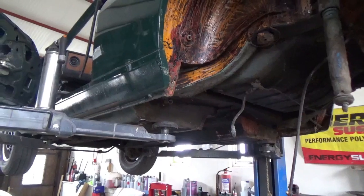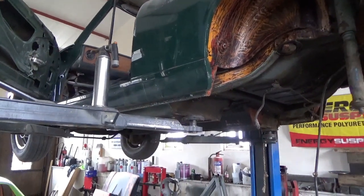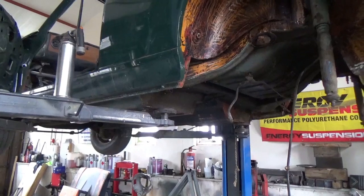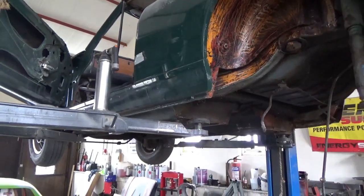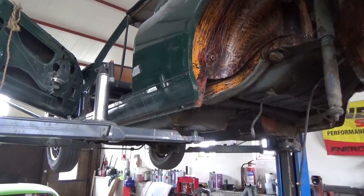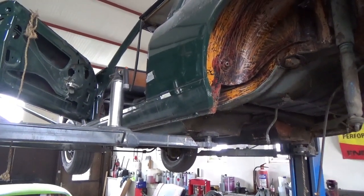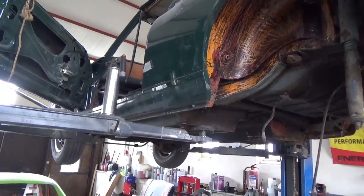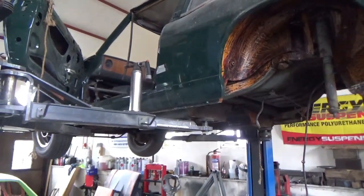So I think the next stage is to take the sills off, check the inner sills, and renew the outer sills and the bottom sections of the B panel. A bit of advice if you're doing a stag: you desperately need to make sure the inner sills and outer sills are correct. They are the key part of the car — they provide all the strength. Even with the hard top, even with the T-bar, they are absolutely crucial to a stag being correct. If you have any doubts about the sills, you're going to have to change them. It's a big, long, drawn-out and awkward process, but it's well worth doing. This car is going for paint and a colour change. There is no point doing a £6,000–£8,000 paint job on a car and then finding out your sills weren't actually that good, and in a year or two they've come through and gone rotten again. The strength of the car is compromised, then you've got to redo the sills and have it repainted again — you're not saving anything. The customer wants the bodywork in perfect presentation, so it will be.